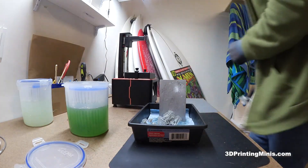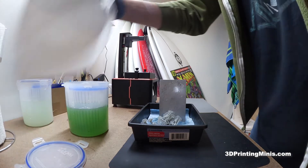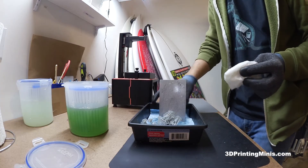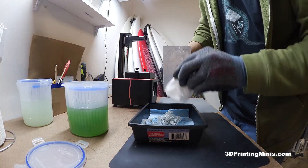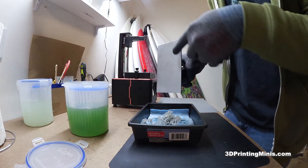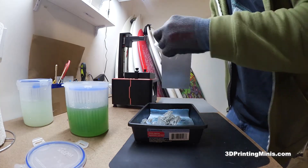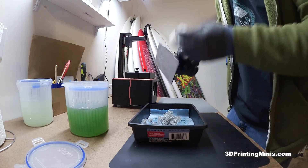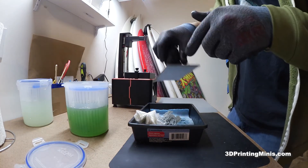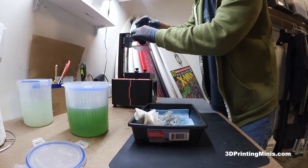I don't want to get Mean Green in my vat, so I'm going to use a fresh paper towel. I could have done this part first — saved a paper towel. All I'm going to do is go here on the vat. See there's a little piece there — I'm going to wipe off any chunks or residue. I scraped it pretty clean, but you might have little broken pieces of cured resin. You don't want those floating around your vat — they'll stick on your next print and cause a failure. Once it's wiped down, the top doesn't really matter. Put it back on. This is ready to print again.